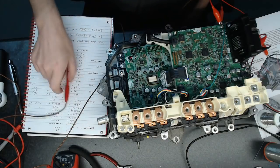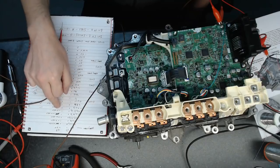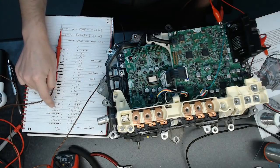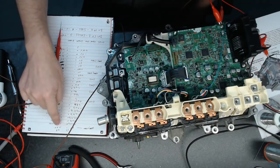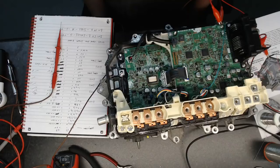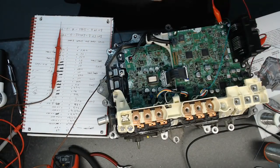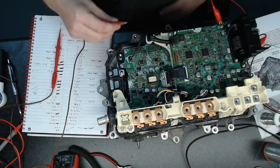So that tells me that these two could well be our enable lines. Now, this is kind of the pattern recognition stuff, and we see we have 6 and 6 potential signal wires. And these two, 49 and 50, could well be our enables. And I might be full of crap, so let's see if I can put my money where my mouth is and see if any of these transistor drivers wake up.